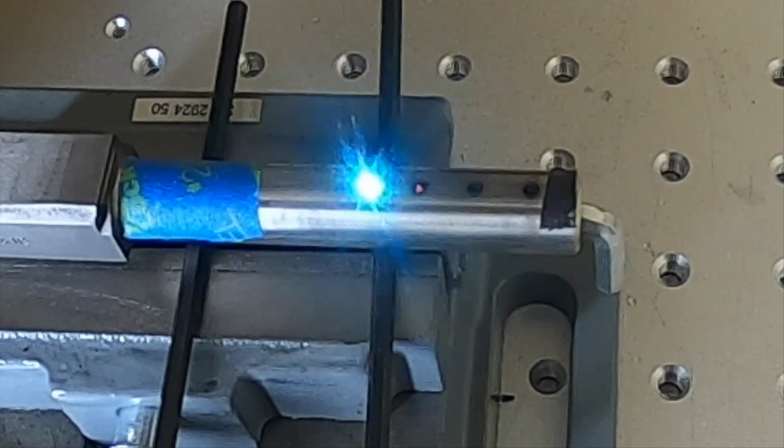One more pause here real quick, because I want you to listen to the laser as well. Hear the sound it makes when it's still trying to break through that last little bit and it's hitting the little nubs. And then finally in the next clip where it does bust through, it's almost got a whistling hollow tone to it where it's broken through into the tube of the barrel. And so you get that different tone. And that's how I'm knowing that I'm all the way through.